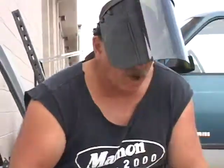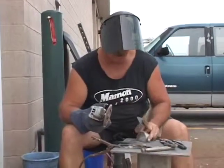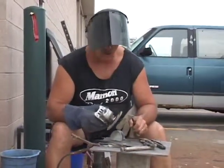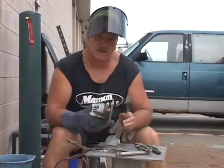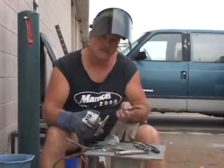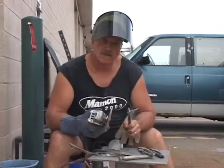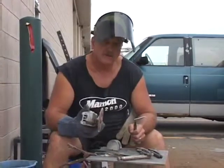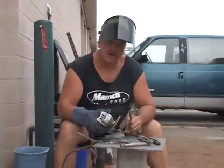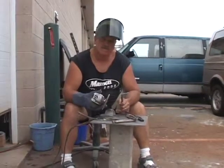What I'm doing is grinding all these small pieces that I've cut out. What I'll do is weld them onto this flat plate that I've made, which will basically be the base for this thing to sit on. I'll weld all these small pieces up and take a torch, heat them up and bend them to make them look like the rips are actually curled out — like it actually ripped out. Once that's all one welded unit, it'll get welded to the rear fender. Once the rear fender has this on it, we'll do the netting. The netting will be formed using the torch and welder to create the net effect. When it's all painted up, it'll look like a real nylon net over the puck. The puck will be painted black and the rip-aways will look like they're actually part of the fender.